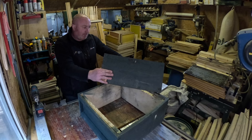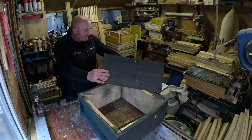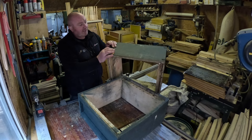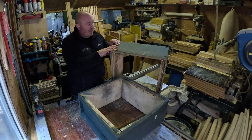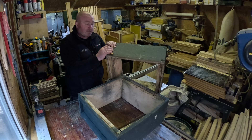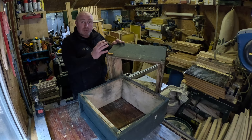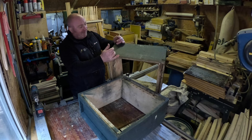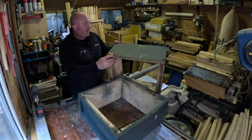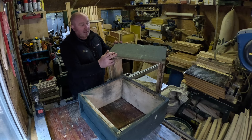I'm not just slating Bee Equipment - I've had some cedar supers and cedar brood boxes off them which are absolutely fine. Just obviously a serious issue with the pine they use. So I've got two choices here: I either dispose of the boxes or I try and do a little fix. I'm going to go with the latter - I want to try and get a little bit longer out of them. But the issue is now that the split's started, it's going to want to carry on as the season progresses, as the box gets wet and starts to expand. My plan is to drill a little hole at the end of the split like you would do with fractured metal, and then use some expanding wood glue within the crack. Hopefully that will grab hold of it and prevent it splitting any further.